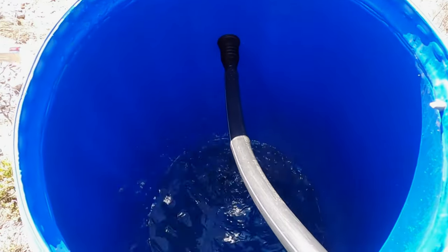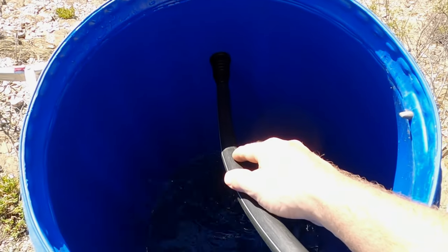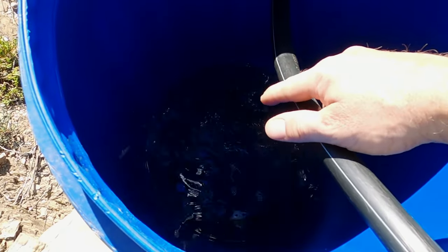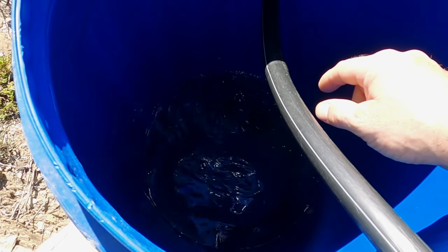You can see I'm filling the tank by pushing the water through the loop into the bottom. There's a lot of air coming up — that's air that must not be in the loop, so this is a good way to prime it.